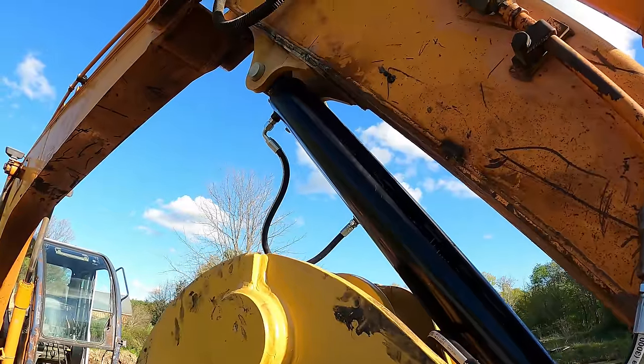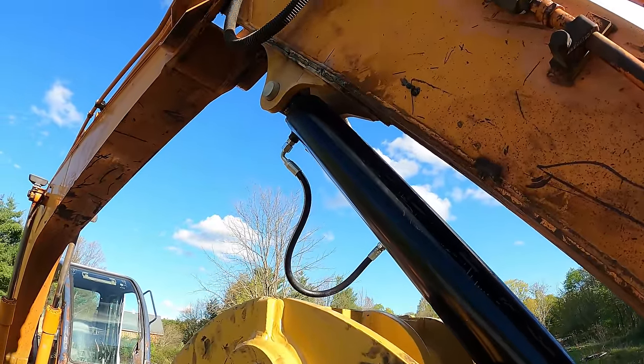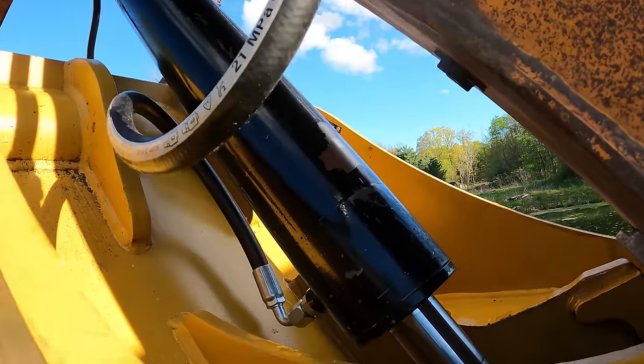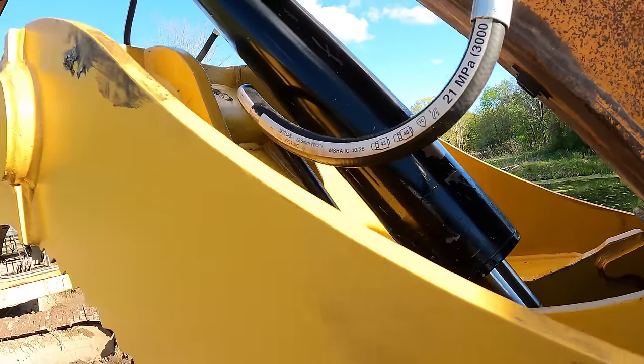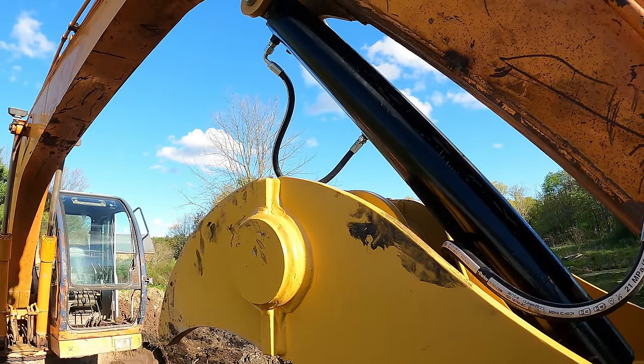That's got a pretty heavy duty wall. Even though it's mild steel, the DOM is still got a half inch thick wall, whereas the old eyelet on it was only a quarter inch. So I think it'll hold up just fine.